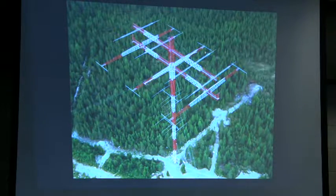And he put some linearly loaded ends on here so he didn't have to make it as long as it would have to be. But each one of these elements is 190 feet long, and it's 350 feet in the air. Each one of the elements weighed 3,800 pounds. And they estimated the lifespan of this thing to be 5 years before they'd have trouble. And it stayed up a year and came down. It had an automatic wind detection system on it, so it would automatically turn itself for the least wind load. And they think that's why it failed. That system quit working and it came down.